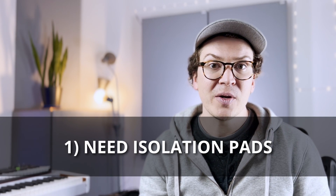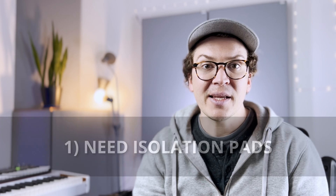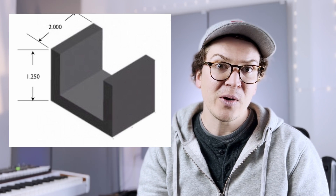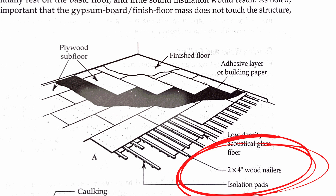To start, when you're building your floating floor, you're going to want some sort of isolation pads to put underneath the studs that are going to raise your floor up. I recommend getting the Isoclip studs — I have a link below. They're basically U-shaped pads that a two-by-four can fit in vertically and sit on top of. You're going to place these pads evenly in a grid pattern throughout your floor, then use two-by-fours as sleeper boards that are not going to be screwed into anything — just sitting on the pads every 16 or 24 inches on center.